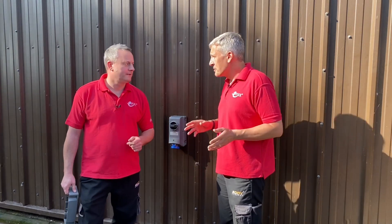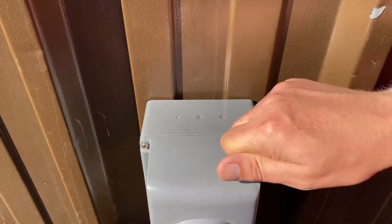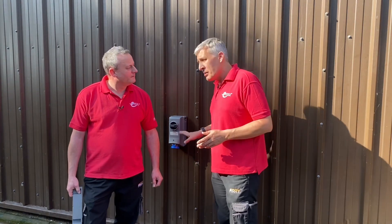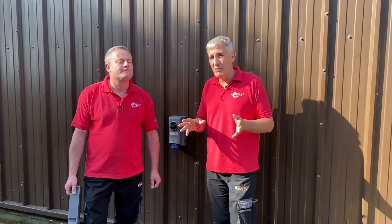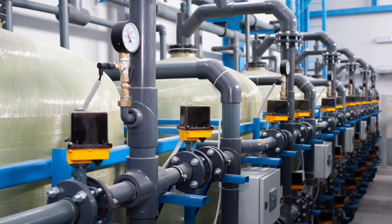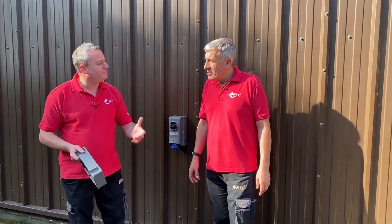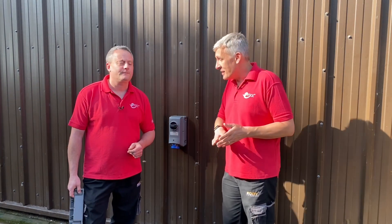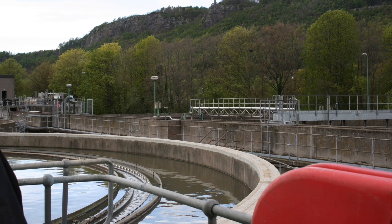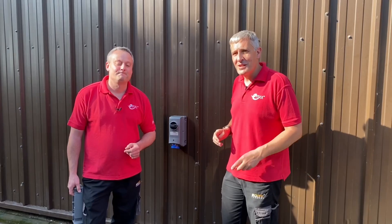Give me some practical environments where I may be choosing this socket outlet. Think of lots of industrial applications — temperature is one thing, but GRP is also resistant to mechanical abuse; they're incredibly rock solid units. Then that other advantage comes in when we think about the chemical environment and its resistance to lots of different types of quite aggressive chemicals. So I'm starting to think chemical works and things like that. The problem comes when all of these happen at the same time — extremities of temperature, salt water, and chemicals simultaneously. And then throw in sunlight if you're outside. Probably one of the best applications is marine environments, sewage treatment plants — anywhere where there's yeah, not places you might want to go on holiday.